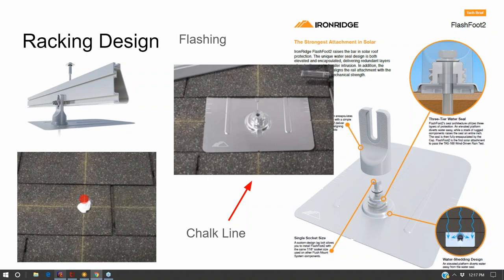And so measuring in the attic or using a hammer to tap the roof is a good way to identify the rafters. What you'll do is do this all the way across the top, then come down and do it all the way across the middle, and then all the way across the bottom. I'll do it independently so I don't get any confirmation bias, with a little whiteout pen where I think there are rafters, and then look at how my map has gone from top to bottom to see if I'm on track or not. Combined with measuring inside the attic to see if the rafters are actually 16 inches on center or if they vary.